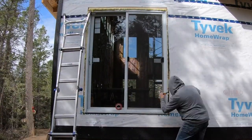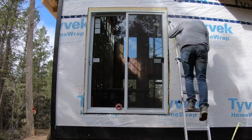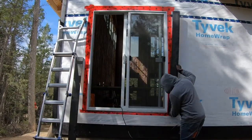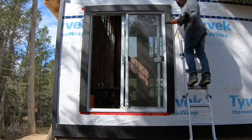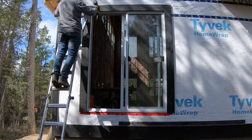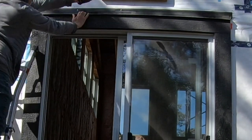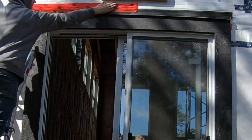Starting on the outside, I will cut the foam flush with the PVC frame and exterior sheeting. Using sheathing tape, I will tape from the frame to the building paper. Cut smart board trim and install with 16-gauge finishing nails. There will be a bead of silicone finishing from the frame to the smart trim around the inside. Once installed, use drip flashing at the top. Create a 1-inch dam at each side and don't nail below the 1-inch line. Tape flashing to building paper.